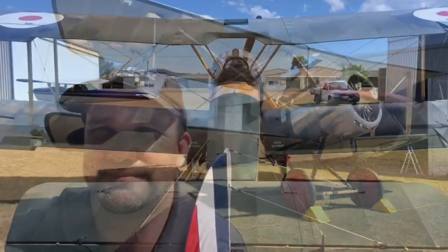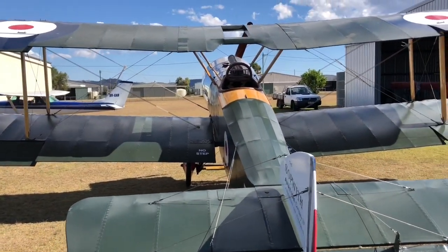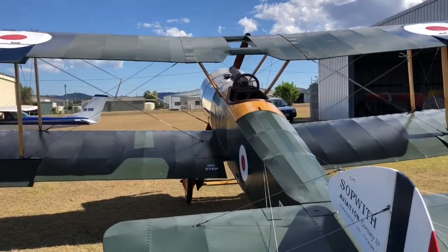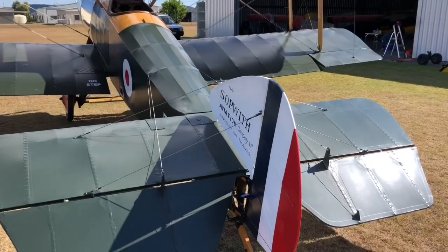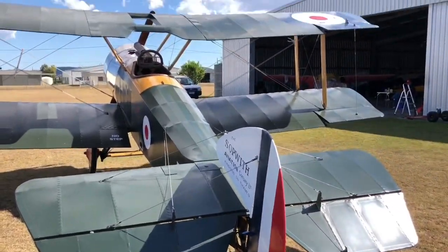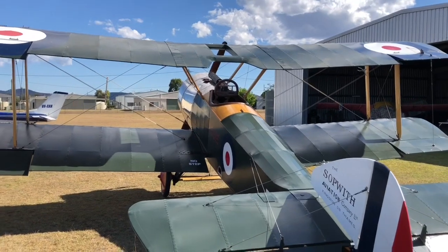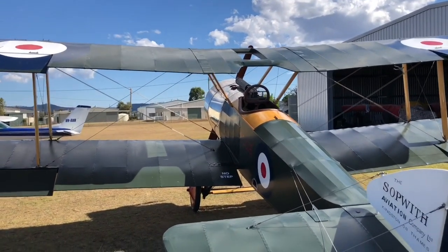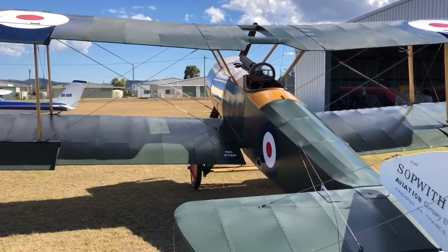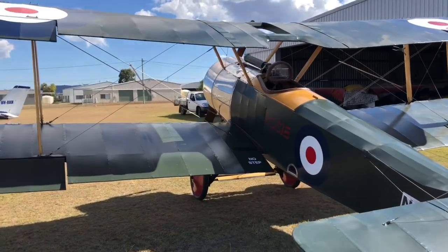You really need to think about that. Need to be aware of that. So all you can do when it starts to swing is use engine power, because there's no rudder that's effective. There's no brakes and you've got no steering. So all you can do is give it a good blast of engine power, and that'll pull the airframe straight again, ish.